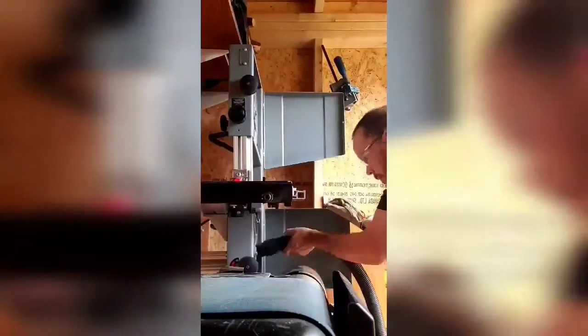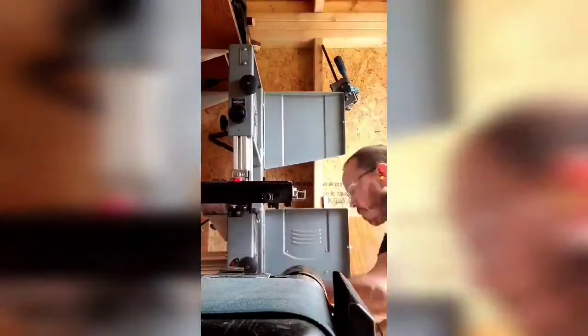Here I had to do it twice because I didn't have time to do it all at once, so I had to do one side, and once that was complete, I did the other side. When I had both sides on, I used a bandsaw to cut out a lot of the excess G10 liners from the aluminum template. Now this stuff is extremely messy, so you definitely want to wear a mask and vacuum your tools because the dust is extremely fine.